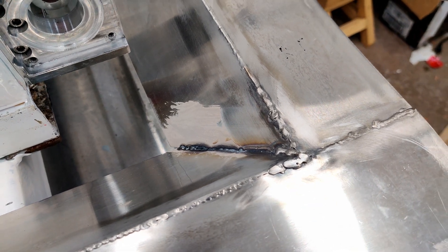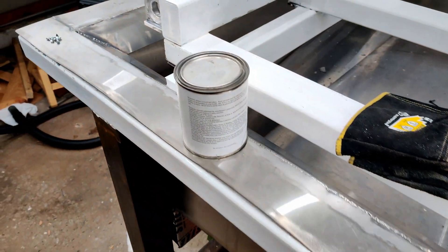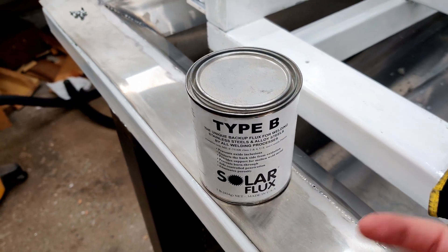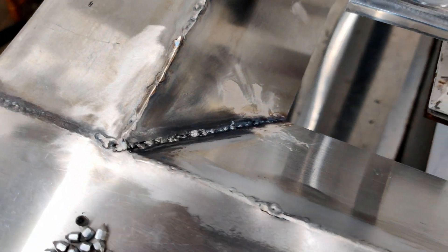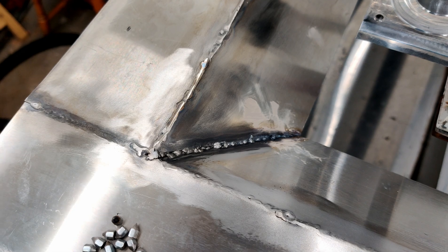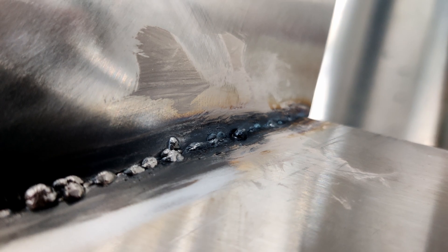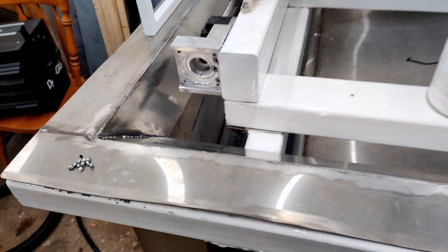On the 45-degree ones it's still kind of gnarly looking. That powdery stuff is Solar Flux Type B — it's a flux you're supposed to use with backing; it absorbs all the oxygen and stops sugaring. But it does leave a really nasty black, glassy material on it. This one especially is really nasty looking — I've got to get in there and clean it up at some point.